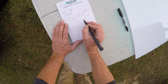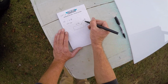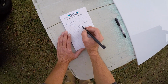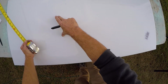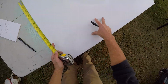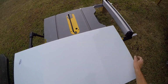So once again, this is the top view. I need outside dimensions of 29 3/8 by 5.5, but the sides are going to overlap the cross pieces, so they need to be cut down 1/2 inch to make up for the thickness of the material here, which will give me ultimately, when it's all screwed together, a box with these dimensions. So I can pretty much go ahead and rip the 28 7/8 cut first, and then I can cut my front piece, my back piece, and then the bottom filler out of that, and then I can take my 2 end caps out of this leftover piece here easily, and that'd still give me all of this to build something with later. And then we're just gonna do a quick test cut.